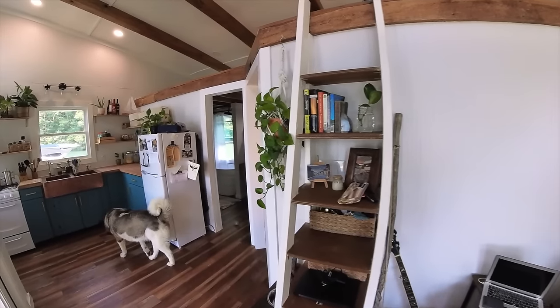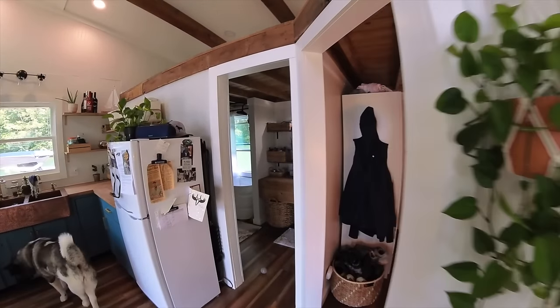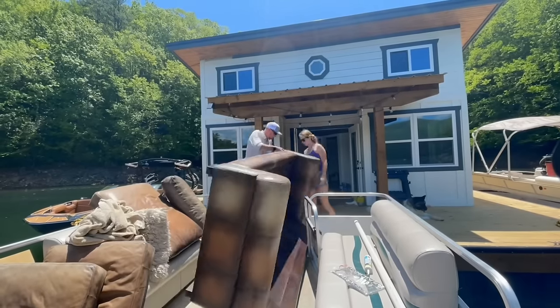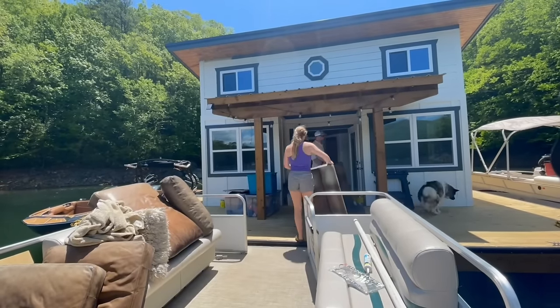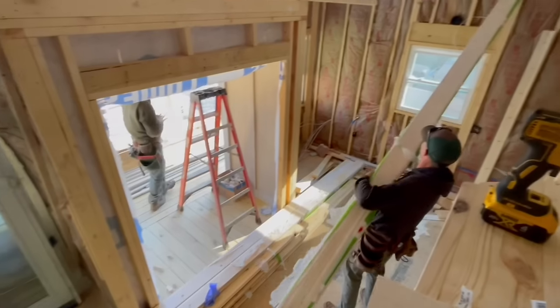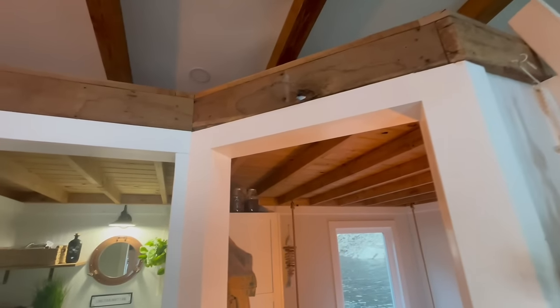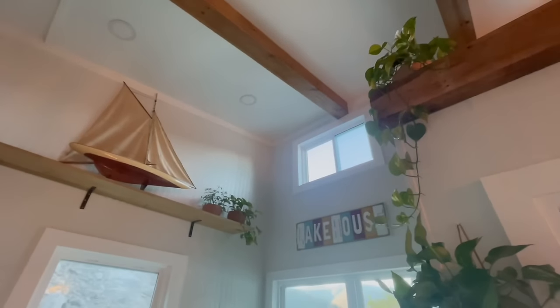And by the way, when we talk about weight putting stress on an area, we aren't really referring to the weight of things like furniture. The things you put inside your house, for the most part, are much less significant in terms of weight than the actual building materials of the structure itself. The tongue and groove for our loft floor in the back of the house, for example, helps counteract the heavier weight from the taller walls in the front of the house.